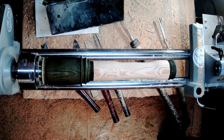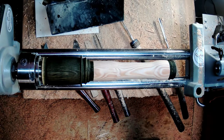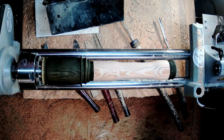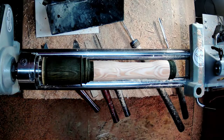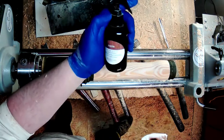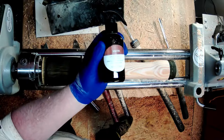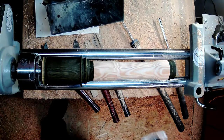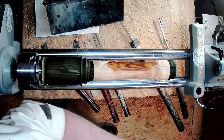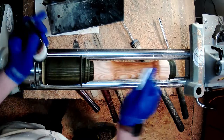There's a question for you there from Dad. How come he didn't seal it? Because I'm colouring it, Dad. You don't seal it first. You colour it first. We'll teach you. If you use stains, you stain first, then seal. If you're using paint, seal first, then paint. So I'm using Hampshire Sheen Earth just to do the handle. Wayne taught me that. And Wayne is the master. Actually, that's quite nice. I like that.